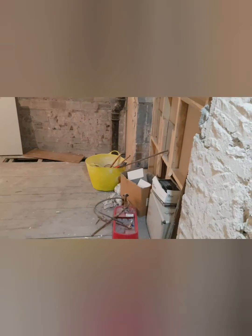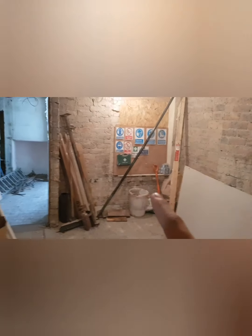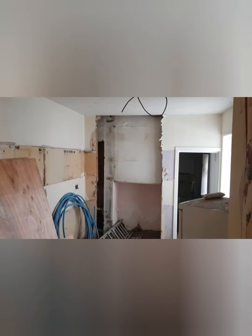Walking through into the kitchen - there you go, there's your services coming down straight into the basement and out. This is getting bricked up. Always think about soundproofing your tenants. There's going to be a kitchen with a bit of a wrap-around here, all the way across - that chimney's getting squared off because it's a bit unsquare. There'll be a wrap-around all the way across, a breakfast bar all the way across, TV in the centre with two plug points. Then there's going to be a fire door here, and we're going to be putting a stud wall or brick wall - possibly brick, it's quicker for this builder who is a bricklayer - with a doorway in and that's your bedroom door. This big chimney is getting taken out; there's going to be steels and a concrete padstone to support the upper part of the chimney.